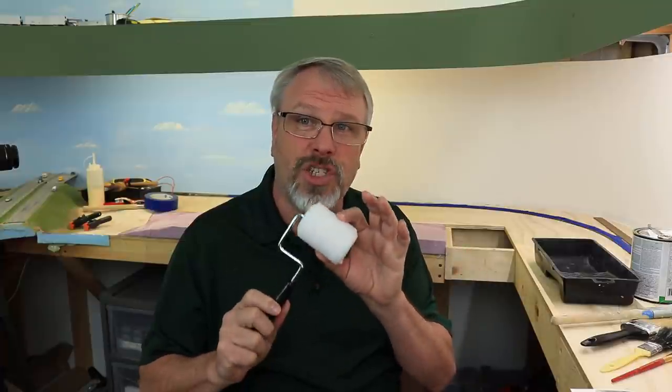Now the tools for the job: for applying the blue I'm going to be using a roller. This is a wide enough backdrop I could use a full-size roller, but I really like working with these small rollers — it helps me work in small sections as I go. Whatever size roller you use, make sure to get a short-napped roller, one made for flat walls or flat ceilings, not for texture. A longer nap is going to provide some texture to the paint, and we don't want that on the rolled part.